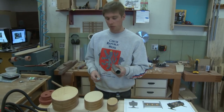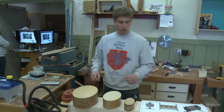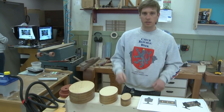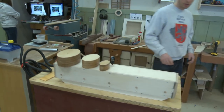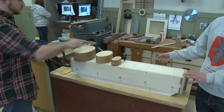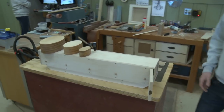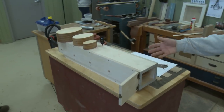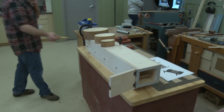I'm actually in the process of doing that. I just cut my piping about ten minutes ago, and I'll get a two-by-four, get that mounted, and you'll be able to basically clamp it to your bench. This is actually the steam box I built a couple days ago for the actual strips — they're a little bit longer than my longest strip. You want to maximize the space as much as you can — there's no sense in making something twice as large for pieces that are this small, so you can kind of heat it up to temperature.